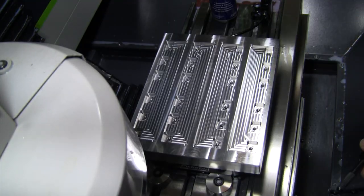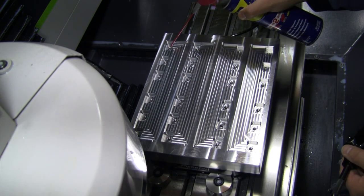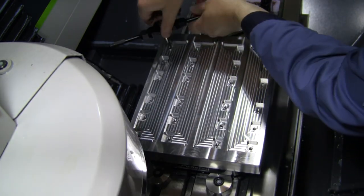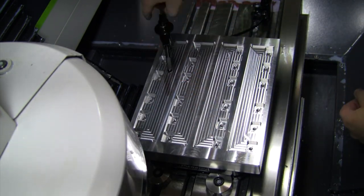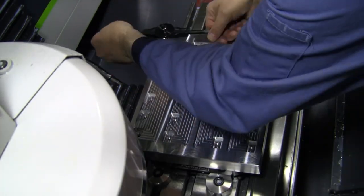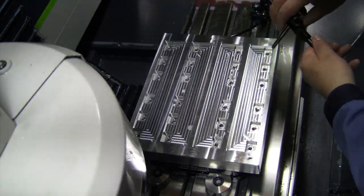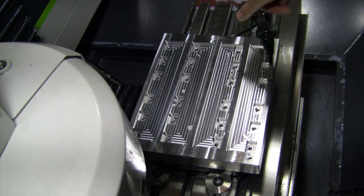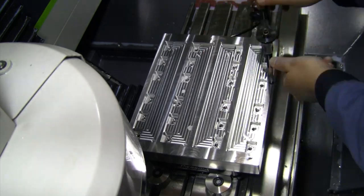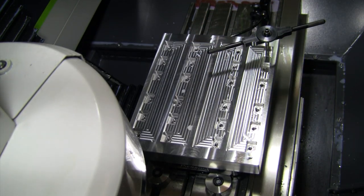All right, let's get these things tapped, helicoiled, and get our Mitee-Bites in there. All right, we did our rigid tapping a lot deeper in the holes on this pallet, and it made the hand tapping go so much faster and easier. Only had to go about a quarter of an inch in there. Got this first hole done, and we're going to skip through all the boring part, jump right in here to the last hole. Get that last hole tapped down the rest of the way, and then we're going to be ready to put some helicoils in this pallet and get it ready for use.